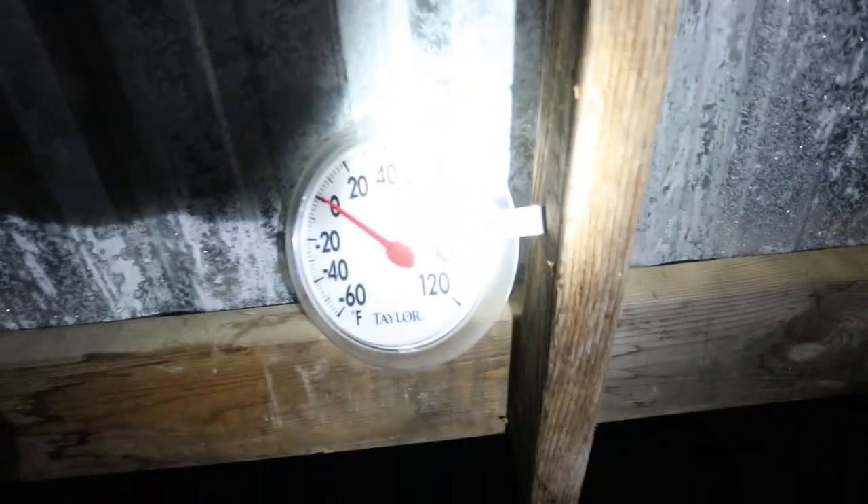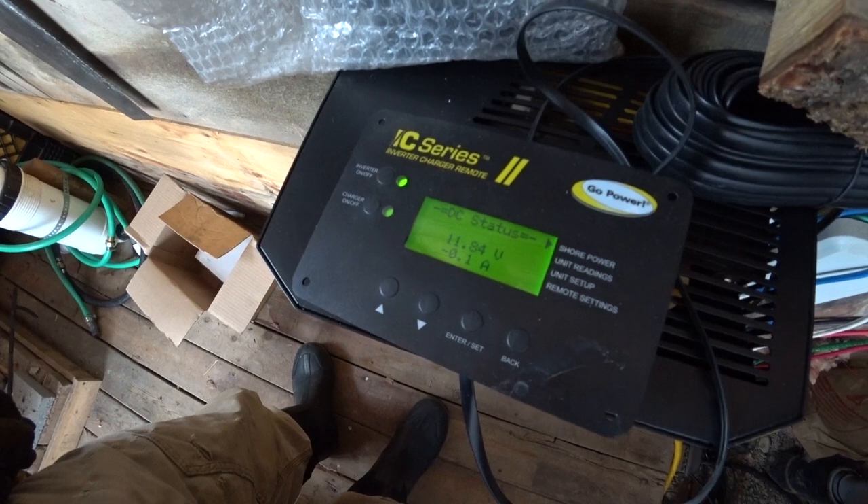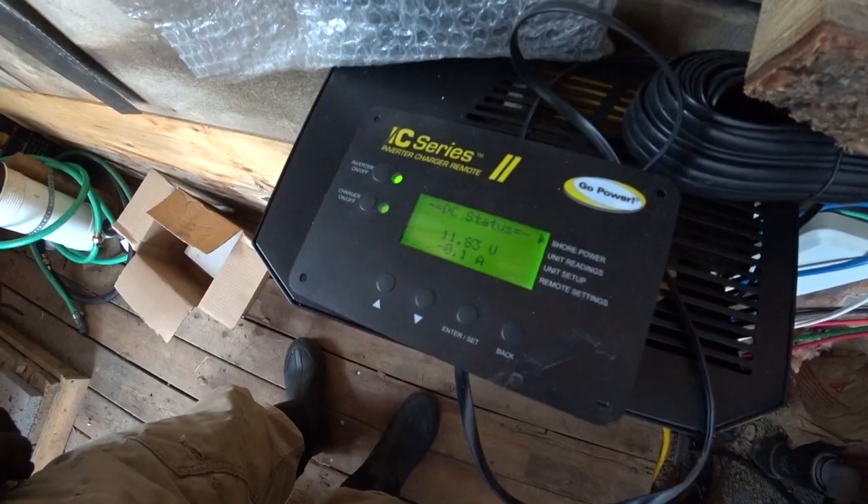So it looks like we're going to be struggling with minus temperatures again. I think in that last clip I was a little delirious — probably because I was extremely tired. This morning, taking a look at the status of our battery bank, it looks like the batteries are holding an okay voltage. I guess I'm just going to spend more time diagnosing. Last night when I tied the batteries together, the bank was at around 12.3 volts. Overnight with the heater and fans running, we've dropped down to 11.83. I'm going to do an individual voltage check to see if those two batteries have come up at all, or if they're stealing voltage from the others.